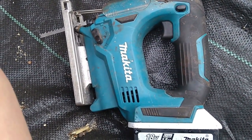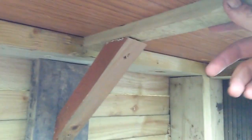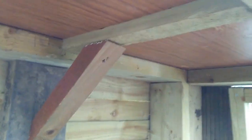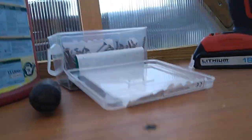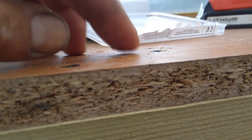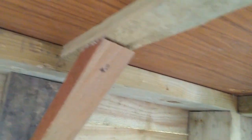And seriously, that is all you need. I have a hammer because what I do is when I'm putting in these bracing pieces like this, I always favour an extra couple of millimetres longer than the gap is — that way you've got to persuade it to go in with the hammer. But that persuasion adds strength. It'll keep it in place without screwing it. Once it is in place, it makes it dead easy then to screw through from above or underneath — I do it from above, so that if the screw does end up sticking out through the wood, it's not going to interfere with your surface.